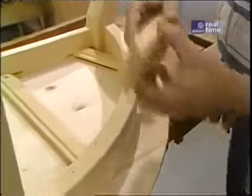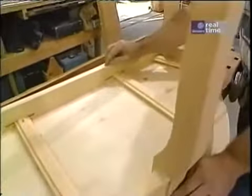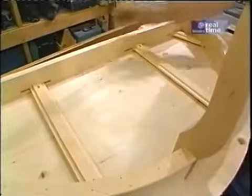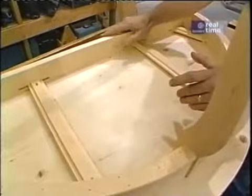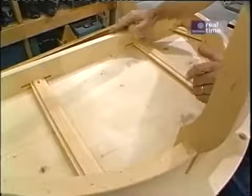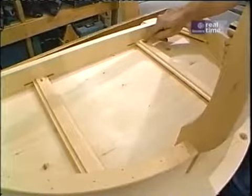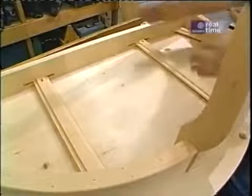That's the strongest way to do it. The other thing was that the antique original had the top fastened with screws driven directly into the rails — that restricts it from moving. In fact, it pushed the table apart. What I've done is installed cleats with elongated holes that allow the top to expand and contract.